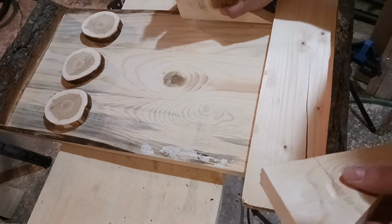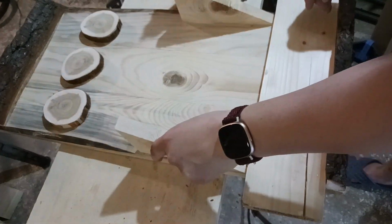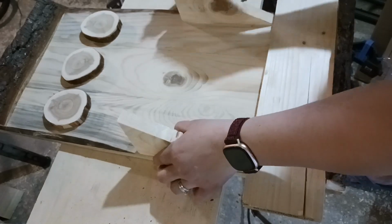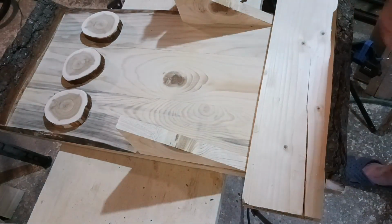I use the same scrap board to line up the sides of the letterbox. Then I glue them into place. Instead of rigging up a series of clamps here, I simply pre-drill, added the glue, then let the glue dry before screwing them in.